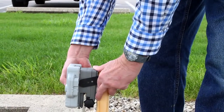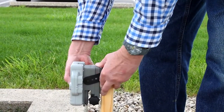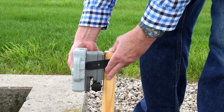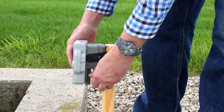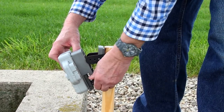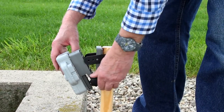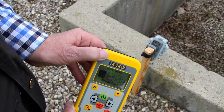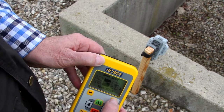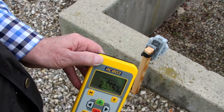The SF803 needs to be tilted towards the DG813 using the pole adapter at the direction stake. Press the M button to enter the menu and select Spot Align, then press the E button to start the automatic alignment.